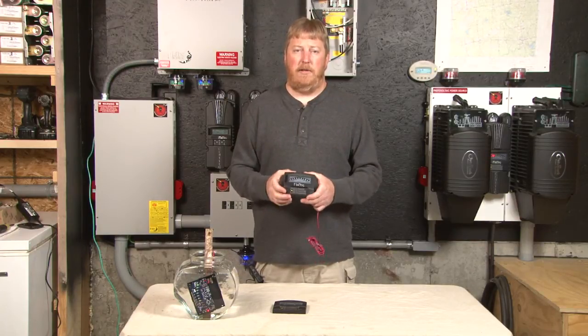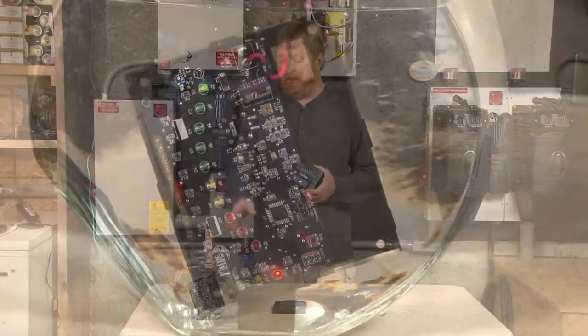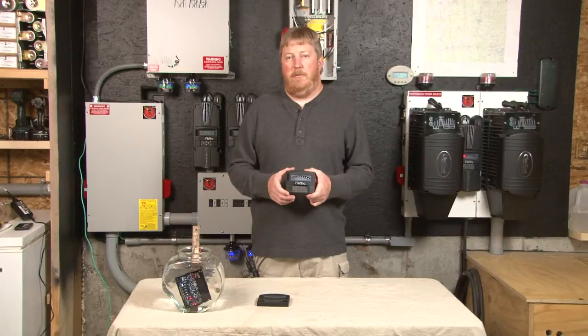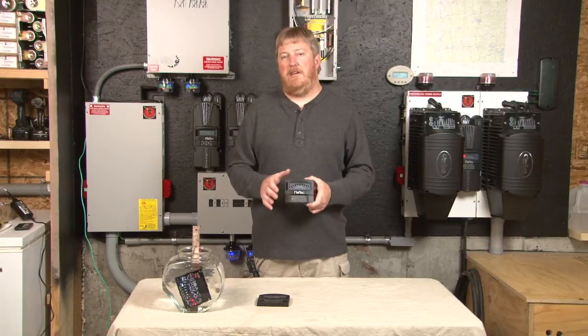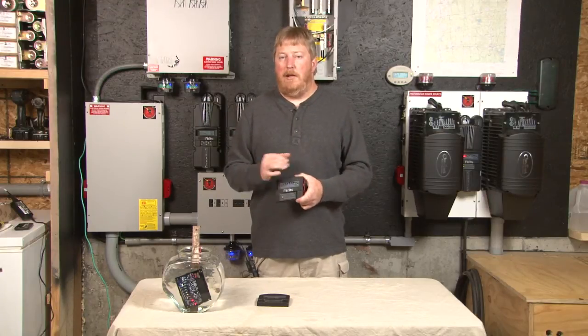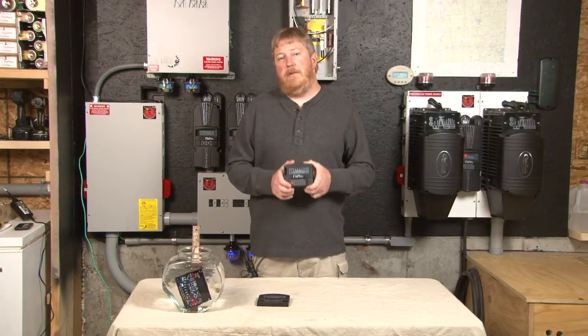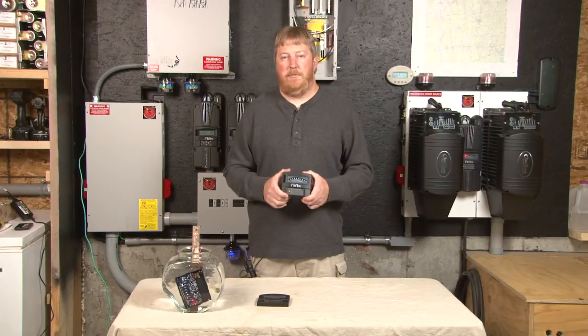Again, that can all be found on a table in the manual. It's a very simple two-wire hookup. And I'm sure you're wondering why we threw that one in the bowl of water — we threw that in the fish bowl because we wanted to prove a point. When we conformal coat our circuit boards, especially the BCM, we dip it in conformal coating so it's completely sealed. That dries into a nice shell that seals the whole board, making it impervious to water. As you can see, it's still working just fine underwater in a fish bowl.